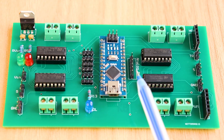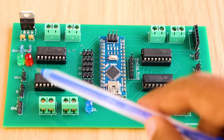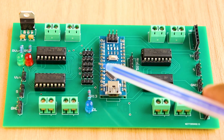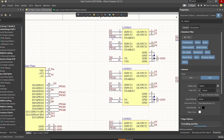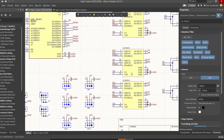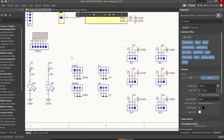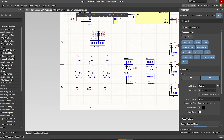That is exactly what we did here. You can see a pair of L293D motor drivers connected in parallel here and another pair of ICs connected in parallel over here. The first pair of ICs drives the first two motors and the second pair drives the next two motors. All the inputs of the L293D motor driver ICs are connected to GPIO pins and all the enable pins are connected to the PWM pins of Arduino. For IC set 1, we use D2, D4, and D3 to control motor 1, and D7, D8, and D5 to control motor 2. For IC set 2, we use D12, D13, and D6 to control motor 3, and A0, A1, and D9 to control motor 4. I have also added some header pins which can be used to connect other sensors and modules to this board directly, and some more that provide 5V and ground connections. This can be used to power additional circuits for further expansion. Also, here is where we connect the HC12 wireless module, which I'll be using to control the board remotely, and I have added some indicator LEDs for easy troubleshooting.